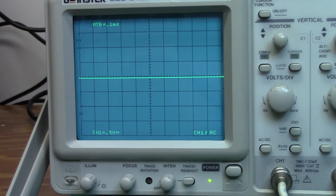One of the things that can happen to an analog scope is this trace or even these readouts can become no longer horizontal. They actually would begin to have somewhat of a drift angle to them. And this is because the beam, which is fired from the cathode ray tube onto the readout or onto the display, is controlled by some magnetic fields.